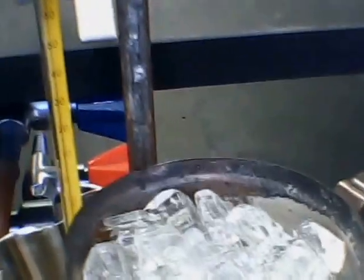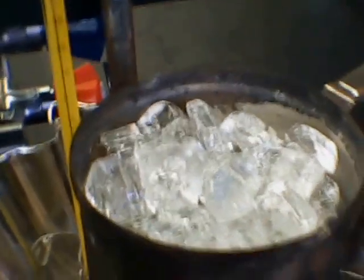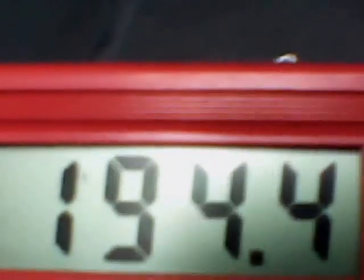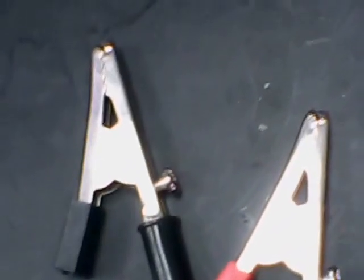As I said, you could probably safely go up to 200, even 220°C — I would stay below 220 myself. I'm not sure about the silicone oil's upper limit; you could probably get up to 300 degrees or higher with silicone oil. Glycerin might be better for you. We're at about 133°C with 1.54 volts. Short circuit shows 199 milliamps dropping, then rebounds to 1.50–1.51 volts.